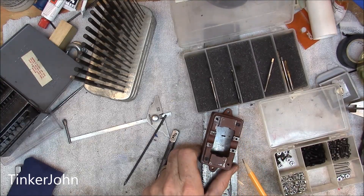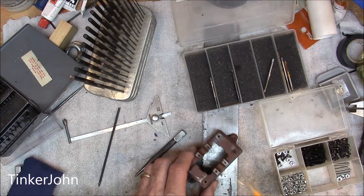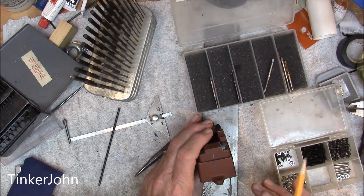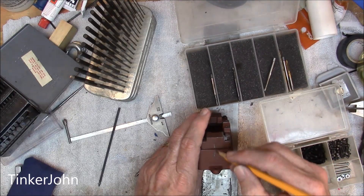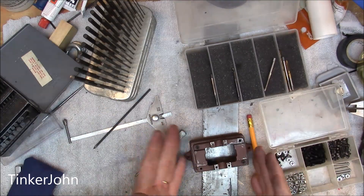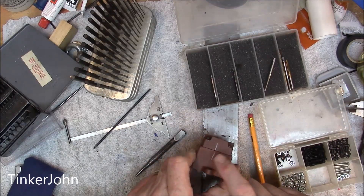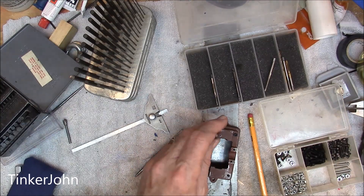Now that I've got the two screws in to set the register, I can just go ahead and transfer the next two screws and drill and tap those without doing anything else. This is also a good time — since I'm not using a fixture — to take a pencil and make some kind of register mark on these, because this is a tight fit. I can move it around and it won't fit perfectly like it did to start with, but as long as I keep that register in line, I'm good to go. So that's what those two lines right there are. First let me do my transfer, then it's off to the drill press to drill, and then come back and tap.